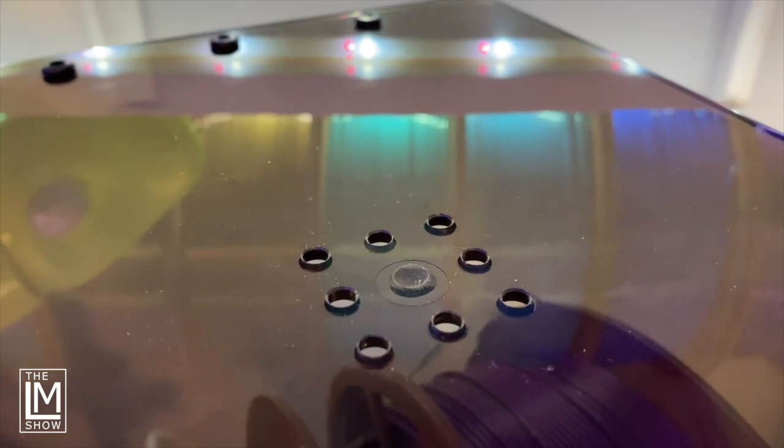This particular FixDry has a 110-watt PTC heater, can go up to 70°C, and it has moisture vents in the top, which are really critical. There was a filament dryer going around last year from a very large 3D printer brand — relatively inexpensive, sometimes given away for $10-$20 — but they missed one thing: it didn't have vents in the top. All the heat was circulating inside to dry the filament, but the moisture had nowhere to go. It got trapped inside and people were seeing condensation building up. The solution was people with drills and Dremels cutting holes in the top to let that humidity out.